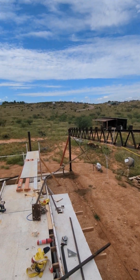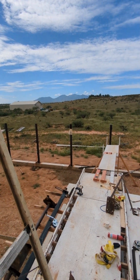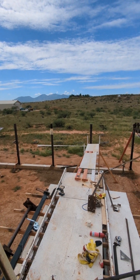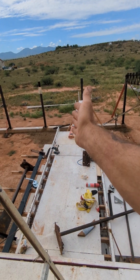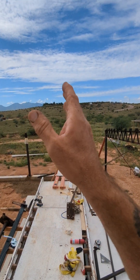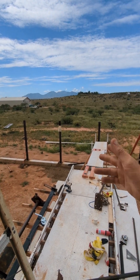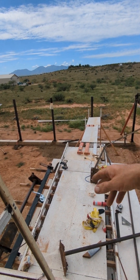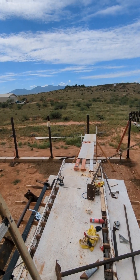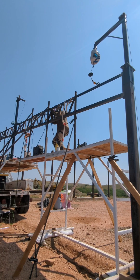Knowing that I was going to make six of these trusses, and if you saw my video on how much these trusses cost to order, it's worth the work — because I'm saving over $10,000 on this. Now I have a system to set up and weld these trusses. I could do 20-footers easily since the truck itself is 20 feet long. For the 40-footer, I had to make a little wood scaffold and use more pallet rack beams to extend the work surface — that's how I get to my second 20-foot section.